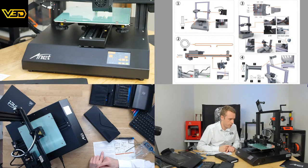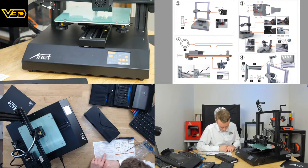So that's going to be a capacitive. No. I always forget which one's which. Capacitive sensor will sense anything, right? So it's sensing glass, so it should be a capacitive sensor, rather than inductive, which would only do the metal or aluminium. I don't think it's that.